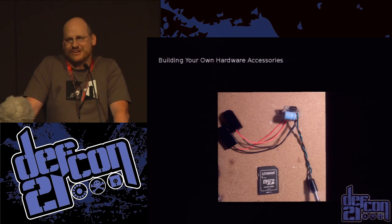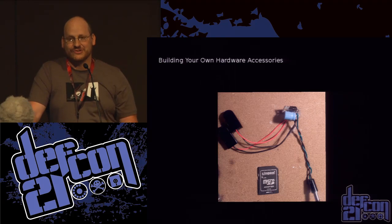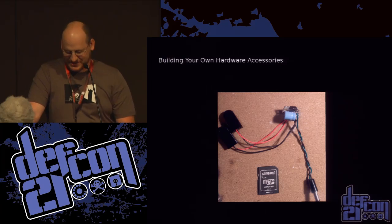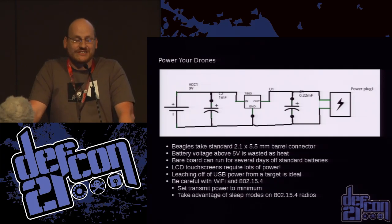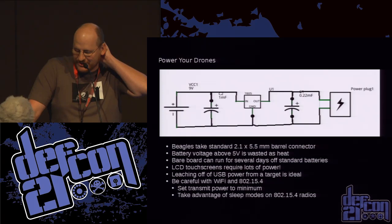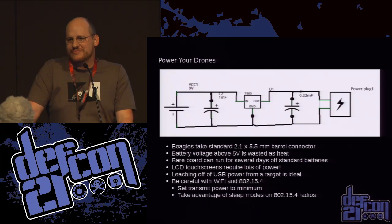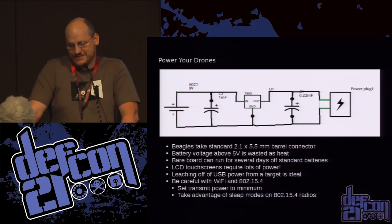Let's talk a little bit about building some hardware. This picture here is of a very simple power supply — pretty small, next to an SD card. To power your drones, I'm using a 7805 linear power regulator and a couple of capacitors to smooth things up, and a battery or two. A word on batteries: a 9-volt battery works great and they're compact, but it's not real efficient — I'm dropping from 9 volts to 5, wasting a lot of energy as heat. And 9-volt batteries don't have a very good energy density compared to D cells and such.